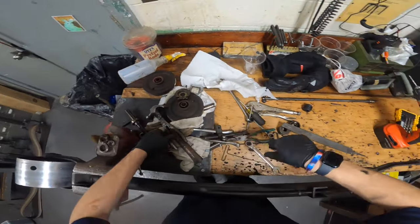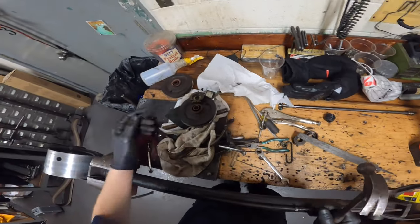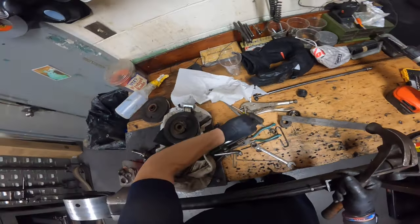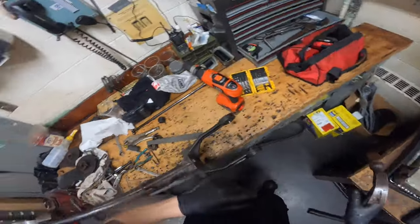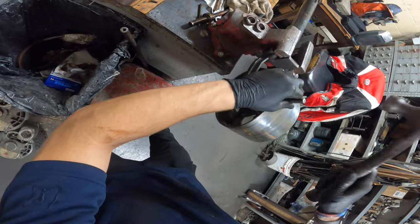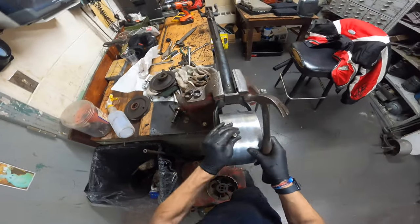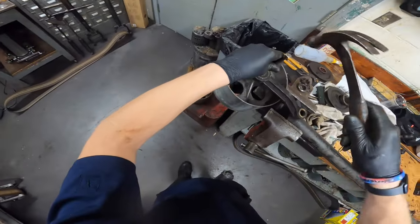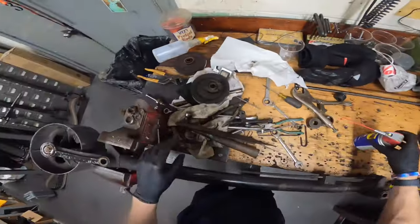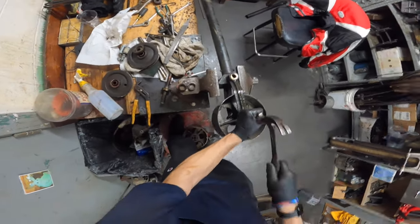See, what I do with the worn-out wheels is: after a while they wear out in the center, and if you try to clamp it down when rebuilding it, it's off center. So what this person used was a big roll pin — you can also use a small bolt — to hold it in there so it's not pressing on one side or the other, it just stays centered. I do that a lot. I actually just put one in on another ball lift that I did that on and they run fine. Sometimes you're better off running them like that than the normal way, because sometimes those bolts get loose.